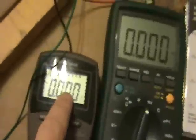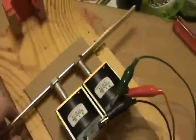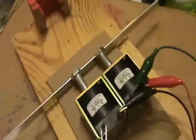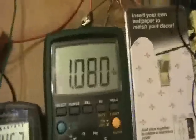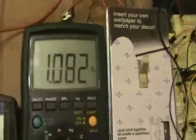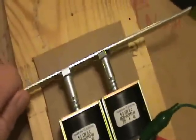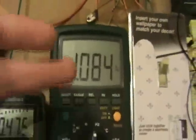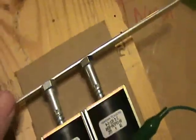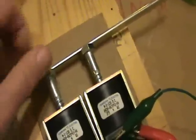So let me show you. We've got 2 meters. This one will show the volts on that 15 ohm resistor, and this will show you the frequency. So what I'm going to do is hold this up here and turn this on. I'm going to stick with this frequency, although this will work at different frequencies. So the bar kind of sticks — I'm pulling it, it's kind of sticking. This is pulsing at about a kilohertz, so that's enough to sort of keep the bar held there.